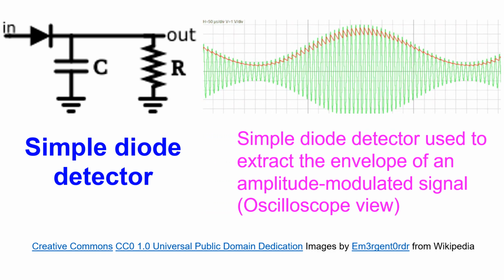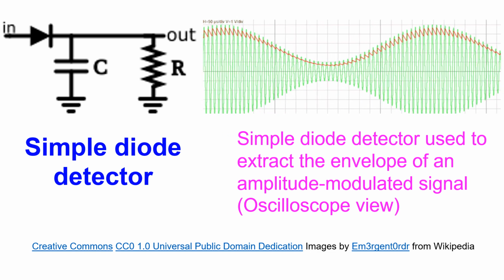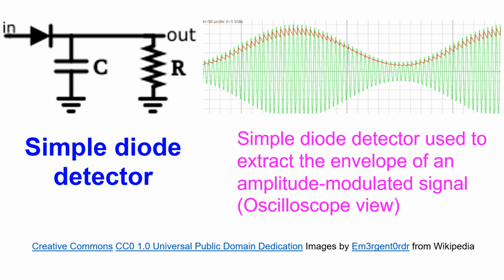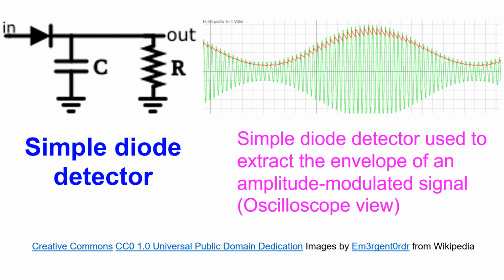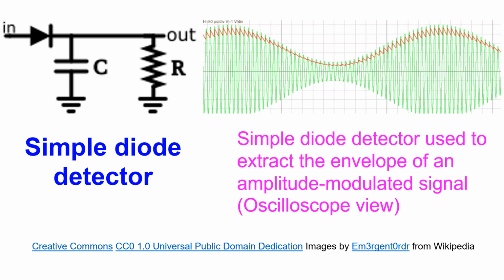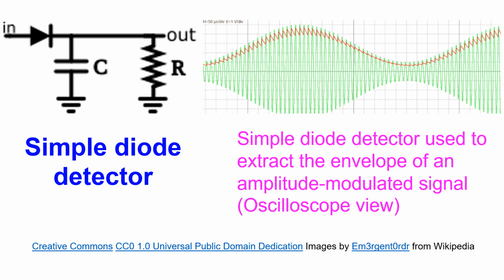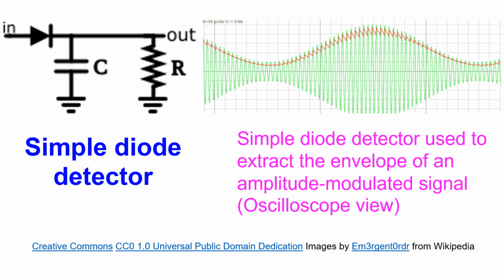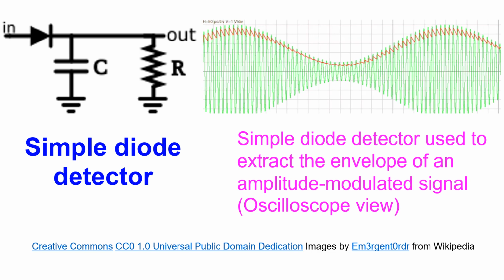Detection of FM signals is by a discriminator, which is a more complex circuit. CW signals will need a beat frequency oscillator to make them audible. Single sideband signals can also be heard using a beat frequency oscillator, which introduces a carrier back to the SSB signals. In single sideband signals, only one of the sidebands obtained after modulation is transmitted to conserve power and improve efficiency.